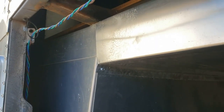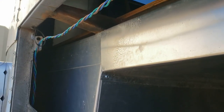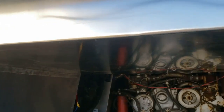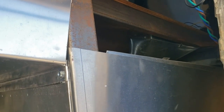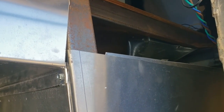I dropped that five inches, so I'll have a lot more insulation back here. Once this is all done I'll pull the flooring up and spray an inch or so of spray foam all the way around all the seams, seal the whole thing up, and then insulate it with rockwool like the rest of the floor — it's better for sound deadening apparently than foam. That's why I'm using rockwool on the floor, and there's enough room that I still end up with pretty good insulation R-factor.